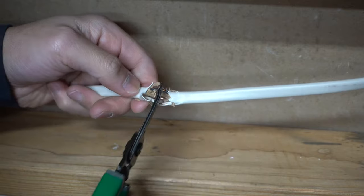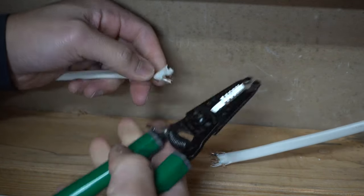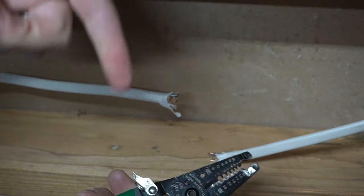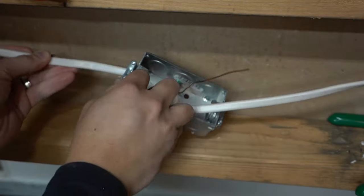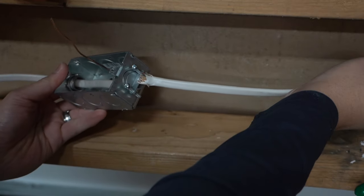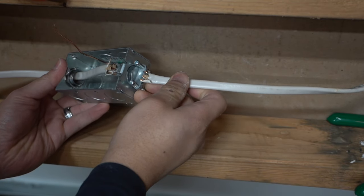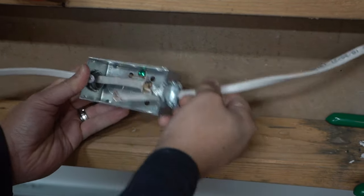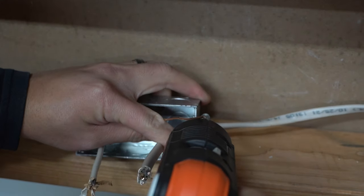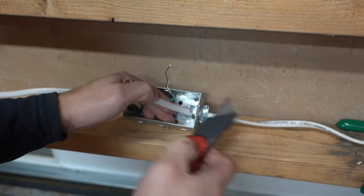With this damaged wire, you might as well just cut it straight right in the middle. What I'm using is wire cutters — any tools that I use within this video I'll leave a link in the description down below. If you do have extra slack that you can pull, even better. But if not, you might have to end up using pigtails to connect these two wires together. You can tighten the NM connectors, then just strip off the sheathing.